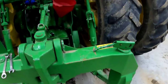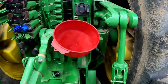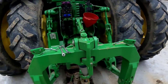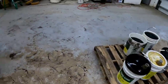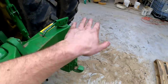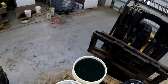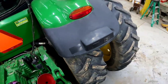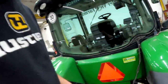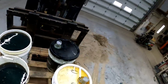Now it's time to add the oil back in. With this 3-point arm and quick attach, it's going to be hard and tiring to hold the bucket up there because it funnels down and takes longer to pour. With as much as we have to put in, I'm coming up with a different plan. I got a pallet, put all the oil on the pallet, and we've got a forklift. I'm going to lift the forks and pallet up to a comfortable height so I can just lean the bucket off the pallet. Use the tools that we've got — make life easier.